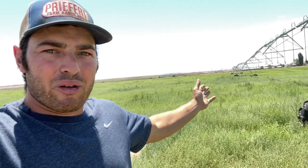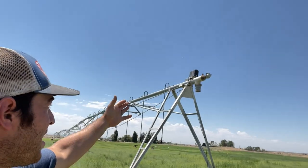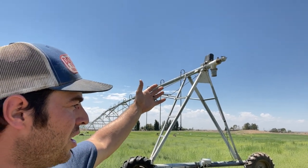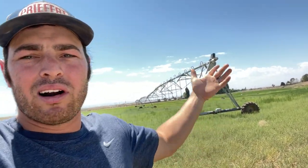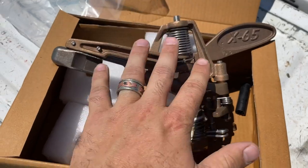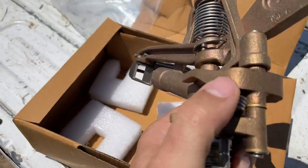What I've got to work on is the end of this pivot. On pivots you have a sprinkler set for so many gallons per minute, and the farther you come out the bigger the nozzles get until you get to the end, where you have a gun — like a big yard sprinkler. It goes in a half-moon back and forth to water because you don't want to go full circle and over-water where the sprinklers are already hitting, or under-water on the outside.